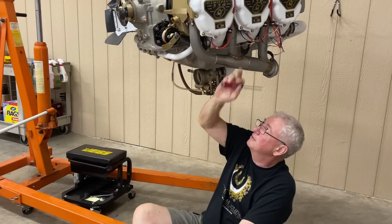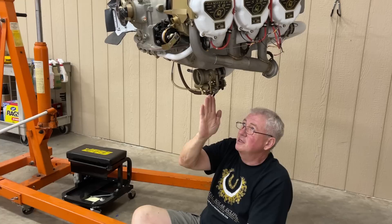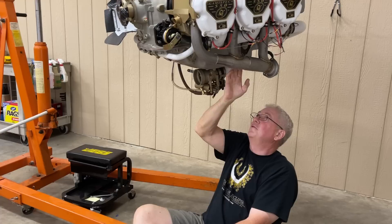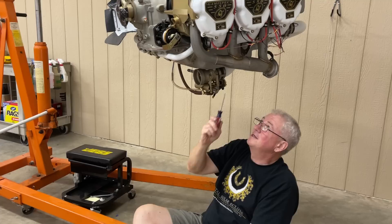It's sleeved in several places right there, right here, and on this cylinder as well — a bit differently on that other side — but it's a little bit larger diameter. What it does is it actually leans in towards the engine a little bit, and that gets to be a bit more aggressive the farther back you go. So this part of the tube is actually underneath the intake.